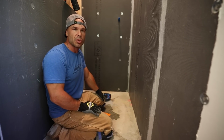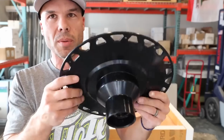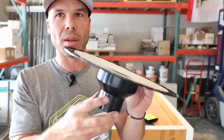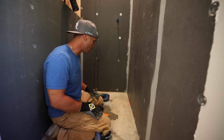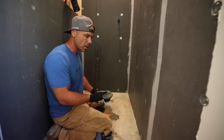If you notice a lot with the Schluter ones that are completely smooth plastic on the bottom, when you do a dry pack or a deck mud float, a lot of times you step on it or something and it breaks bond, and then it's kind of loose, and you definitely don't want these things loose. You want them locked into the mortar. So we're gonna put some thin set underneath them, then put the deck mud in.